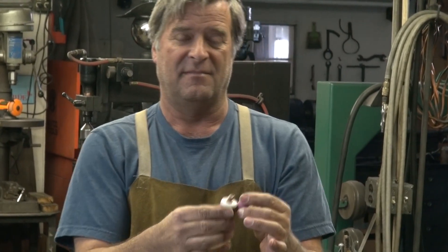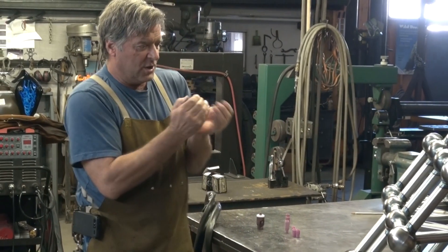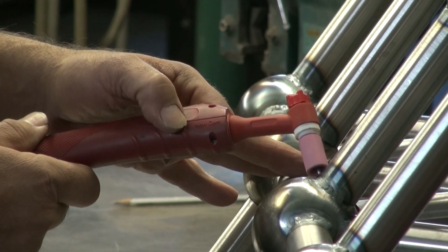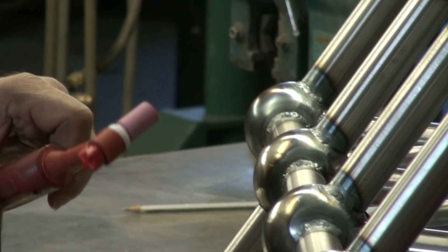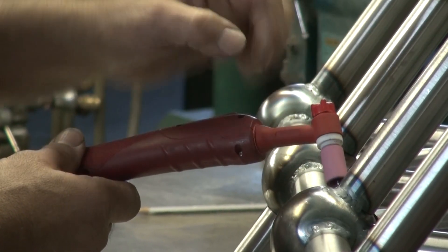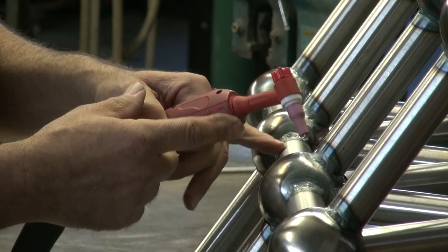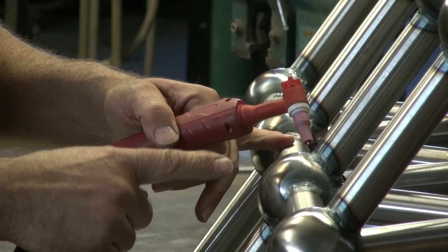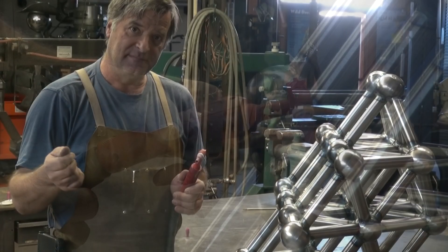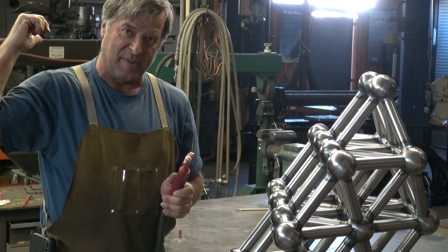How do you know which cup to pick? It all depends on where you're working. When you're working down in a tight spot like where the weld is here, this number 7 cup is pretty big and it's hitting the metal on both sides. Let me change and put the smaller cup back on it. Same spot, same torch, but this is a number 4 — much smaller opening — and you can get a lot closer into the weld. The pressure and flow rate are still the same on the gas coming out of the bottle.